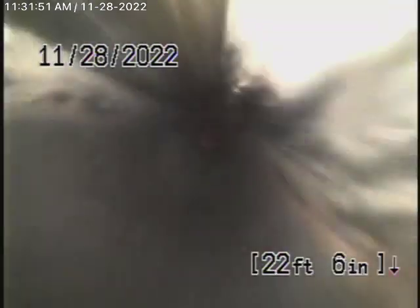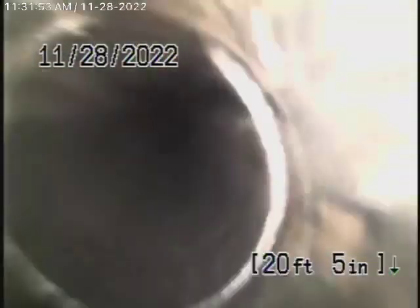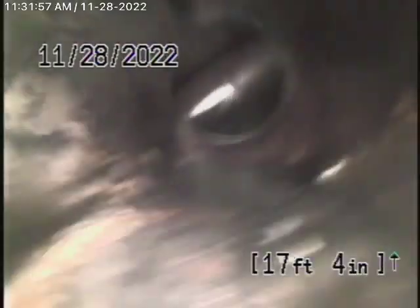You're going the wrong way. Let's bring this back. So something's not right underneath this house. Whoever did the plumbing under this house didn't do a proper job, that's for sure, because that T is not a directional fitting anyway. So we're going to keep coming back up the roof vent, and we're going to try a clean out underneath the house that we'll try to run our camera from.